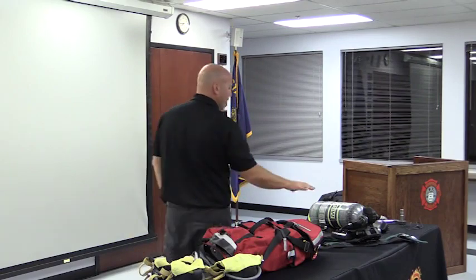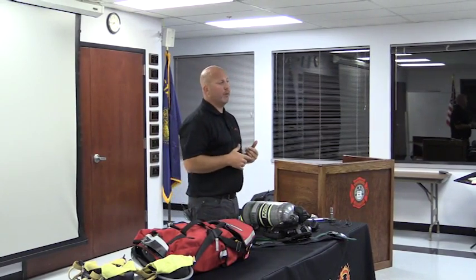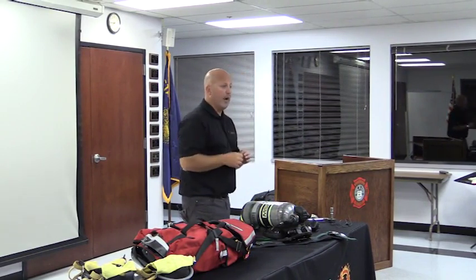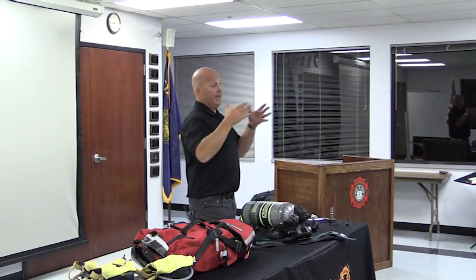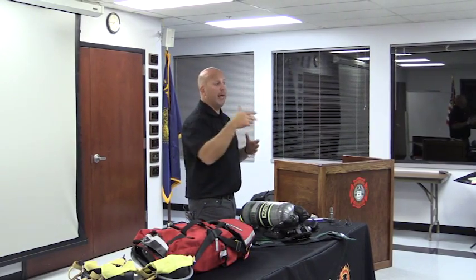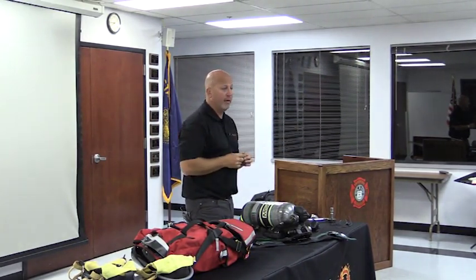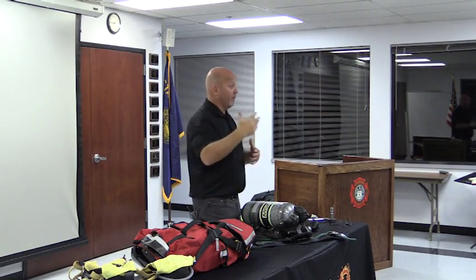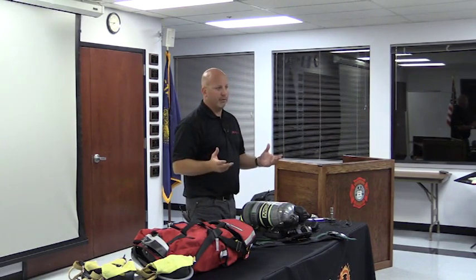Your new SCBA is just like your current SCBA. You have what's titled a universal rescue air connection. It's a high-pressure, quick disconnect located within 4 inches of the cylinder coupling nut. It's been required on breathing apparatus since 2002. The whole intent is that when we go in for RIT, brands X, Y, and Z all have the same type of fitting and function the same way, so we can bring air into a downed firefighter. It's spilt milk, but I think everybody knows that now. If you follow me, it's not anything new. There is nothing different with this breathing apparatus and its universal rescue connection.